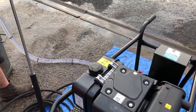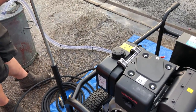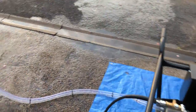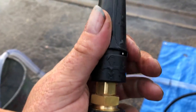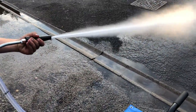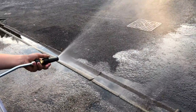What we'll do now is switch over to the barrier four-in-one nozzle and show you how that works. This is the barrier four-in-one nozzle — you'll see the instructions on the nozzle itself. It pushes forwards, then pushes back, and you can turn it to change the spray angle. I'm on high pressure at the moment, and then we're changing the spray pattern — you push it forwards and we're then down onto rinse. Pull it backwards and you're back up to high pressure.